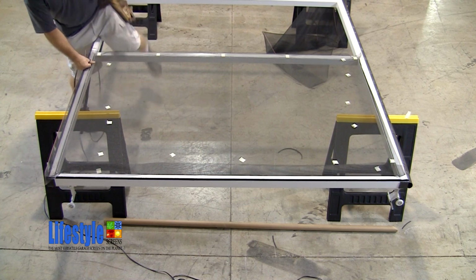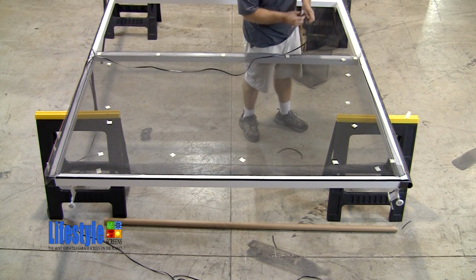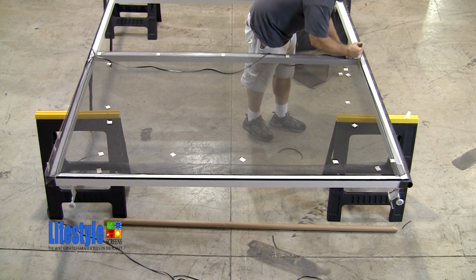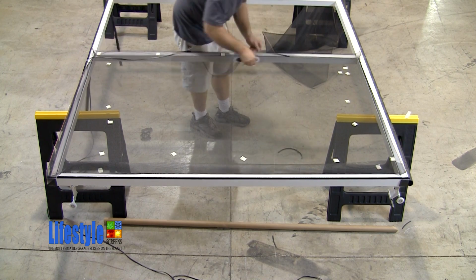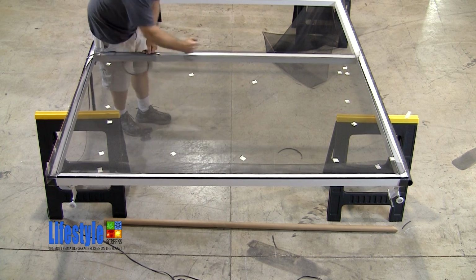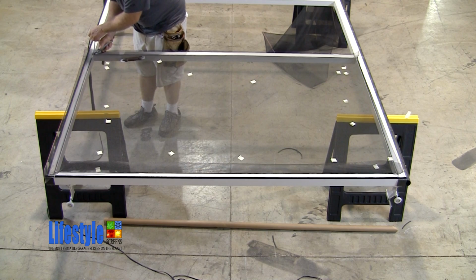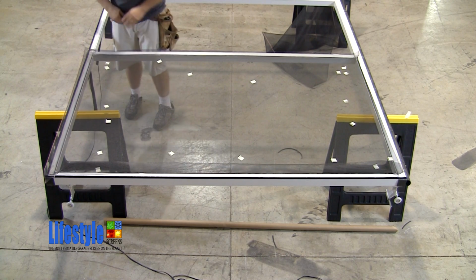Now he moves to the inside vertical extrusion. Once again, he's repeating the same pre-rolling and spline insertion that he did on the previous 3 sides. One thing that you want to be sure of is that your spline is completely rolled into the spline groove. As you sight down the spline at eye level, the spline should be completely smooth in appearance. If there are waves, take your spline tool and roll the spline completely flat before you proceed to cutting the screen.